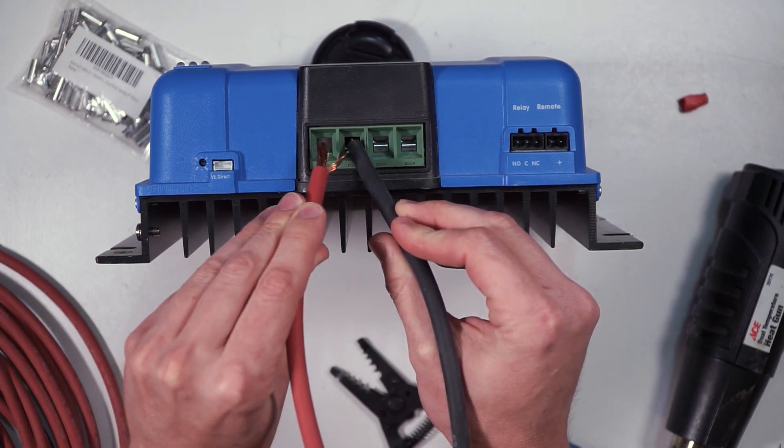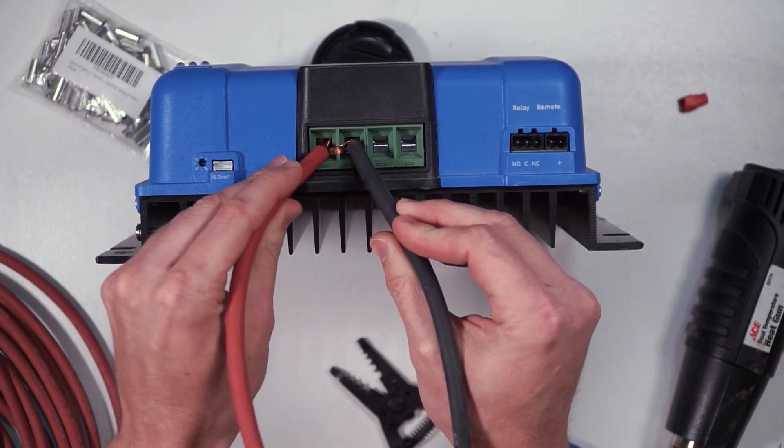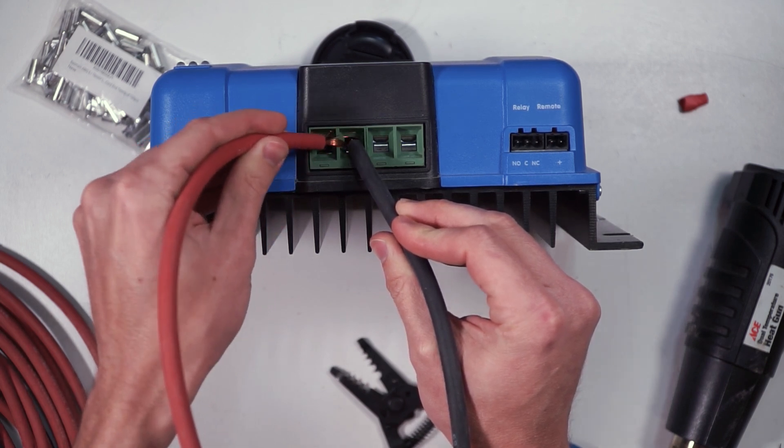How do wire ferrules make wiring safer? When wiring up a charge controller or something similar where the terminals are right next to each other, with a stranded wire there's a chance that if you aren't careful a few stray wires could make their way into the neighboring terminal, causing a direct short and potentially heating up enough to melt the plastic enclosure or even start a fire. This concern is important enough that for certain electrical applications in Europe, ferrules must be installed when wire ends to pass inspection. These just haven't caught on in the US for some reason, but obviously I'm a fan of them and they just look nice.